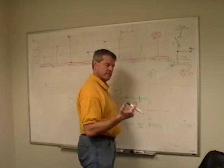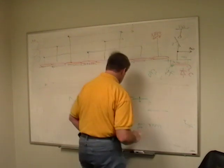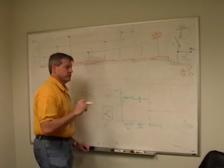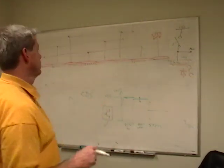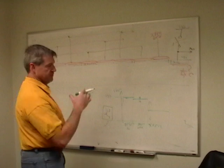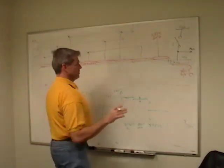What's below pico? Milli, micro, nano, pico, femto. This is in femtofarads probably, or maybe even attofarads. So this is a really small junction capacitance, and you want it to be, because you want a few electrons to make a big difference. Some of the modern imagers can count single electrons, 2, 3, 4, 5 electrons coming in. And then they have multiplying stages and things like that, but that's beside the point.